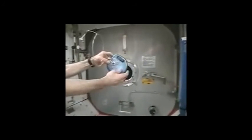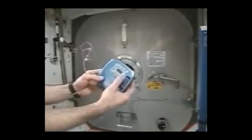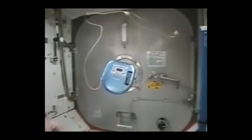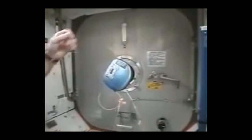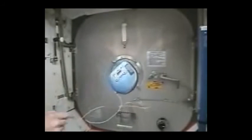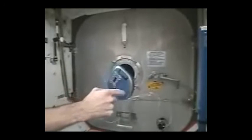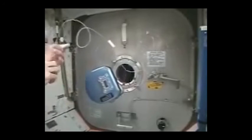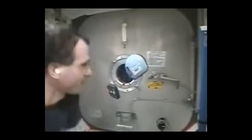If you just give it a little push, it just sits there and tumbles end over end — it's not a very stable platform. Now we're going to turn it on and watch what happens. It's got a CD in there and it's going to spin up. While it's spinning up, it starts to rotate the opposite direction. Then once it reaches steady-state motion, it just sits there. And now, when you push on it, it's been stabilized by a gyroscope inside — out of a compact disc. It's amazing that a spinning CD provides enough stability to show this kind of behavior.